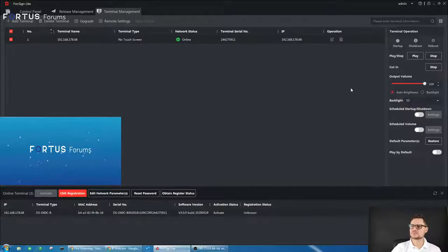You can find the software version 1.1.0.50 on the Hikvision portal — I'll post the links in the description below. You can also adjust the backlight to increase brightness. Regarding firmware updates, it's not like a simple recorder update — it's a zip file for Android, so the whole Android needs to be reflashed. If you got it from us directly, it will already have the proper firmware loaded.